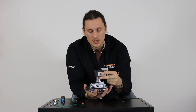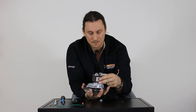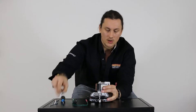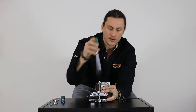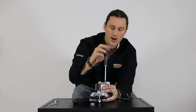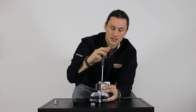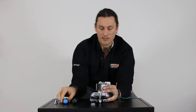We're going to slowly slide the magnet back down over the armature. You're going to feel it kind of lock into place. The first thing I'm going to do is put in the screws that hold the magnet to the motor casing. We have our first screw with the ground wire — again, if you don't have a ground, leave that green wire off. Just starting to thread these in, not tightening anything down at this point, just getting them initially threaded so the motor is secured to the magnet.